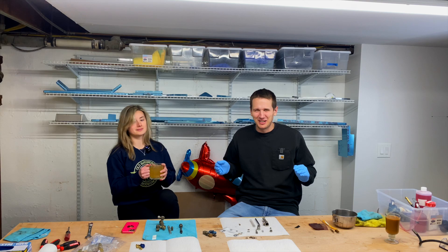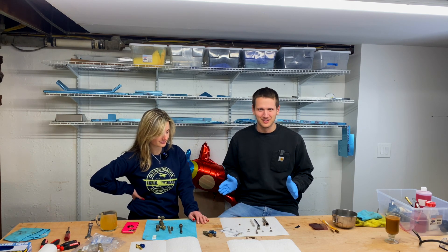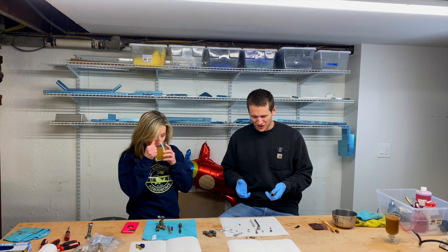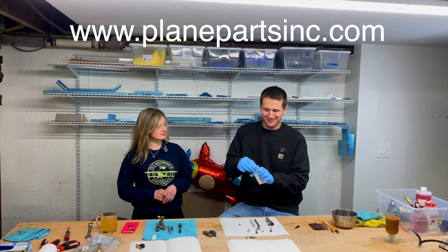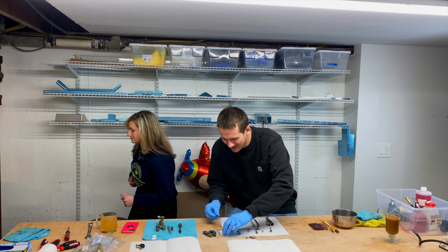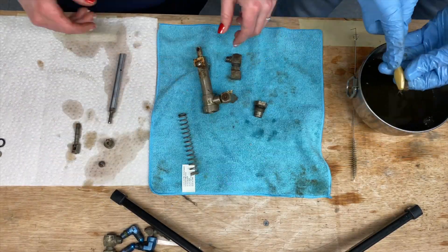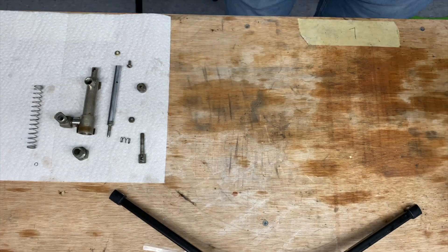We've been out of commission for a week with seasonal colds. We currently have our brake master cylinders for the airplane — they're toe brakes, Cleveland 10-5s. The parking brake was cut off, so this one is all taken apart, cleaned, checked, and looked at. We're going to put it back together using our rebuild kit, which we finally sourced from Some Plane Parts — the guy even next-day-aired it to us. We're using mineral spirits to clean the components, and replacing all the gaskets was a very delicate process but satisfying knowing we'll have a freshly rebuilt system.